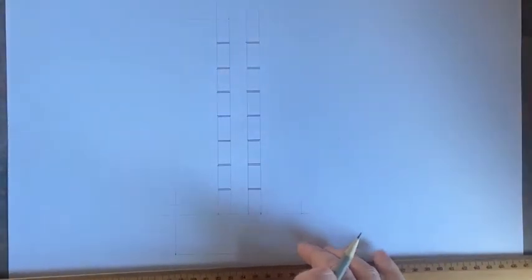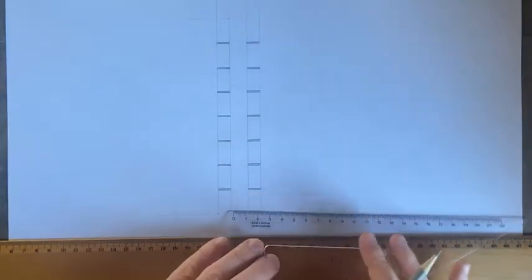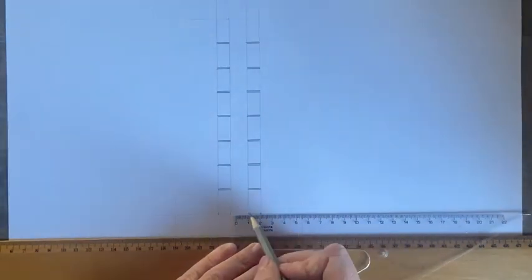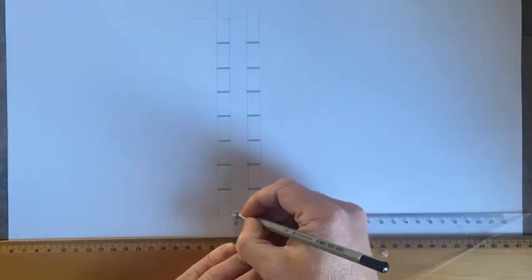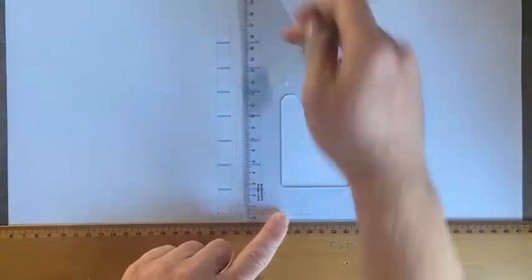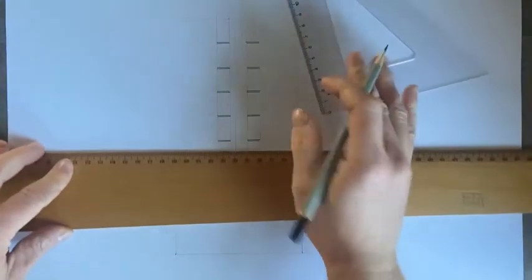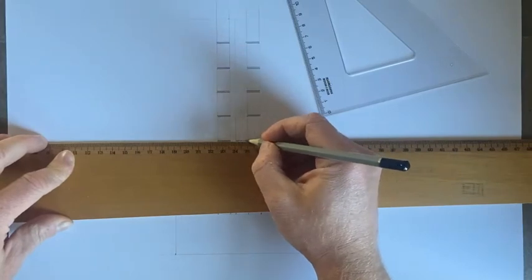Our wall is nearly finished — there's just one little bit we need to do, and that is include insulation and a thing called infill. We should have 150mm of a gap here. We're going to measure 10mm from the right-hand side and draw a nice light line up. From the top of our third block, we're going to draw a light line straight across — actually we can do this heavy.